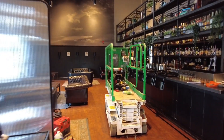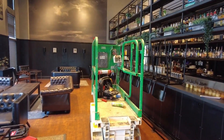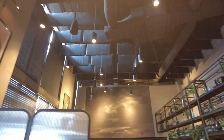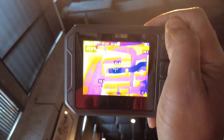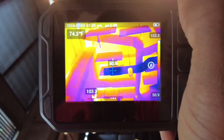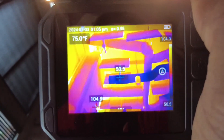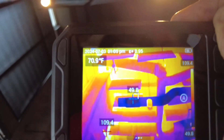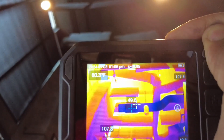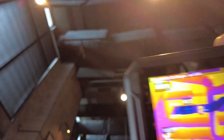For jobs like this where you have to go up on a scissor lift and you don't want to be maneuvering it over to put your psychrometers in each register, I use this thermal imager. As you can see, I've got a low temperature of 50 degrees — right on the money. I measured 49 degrees with my psychrometer when I was up there, so that saves time for sure. That's for that unit's supply.